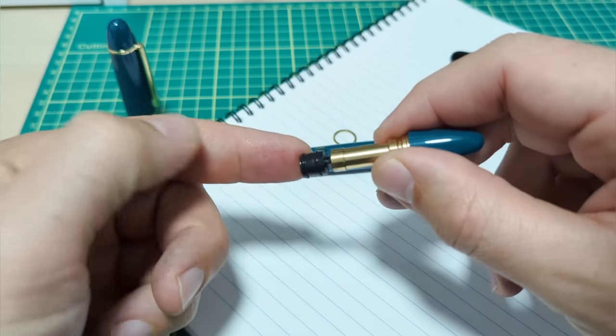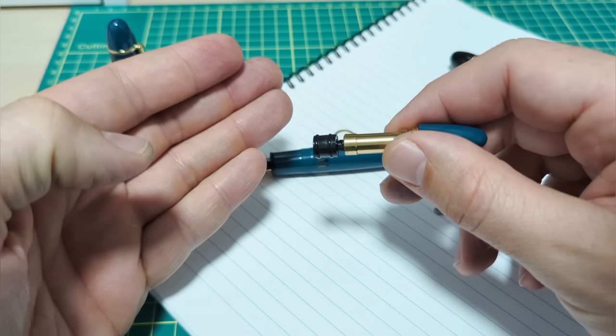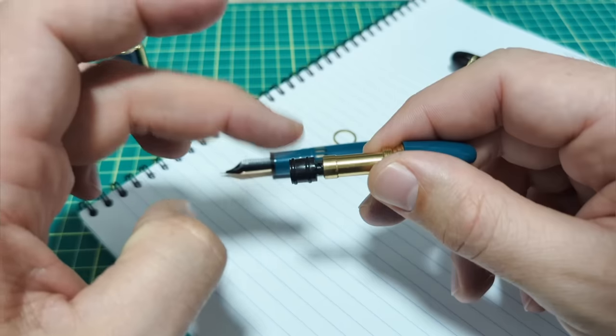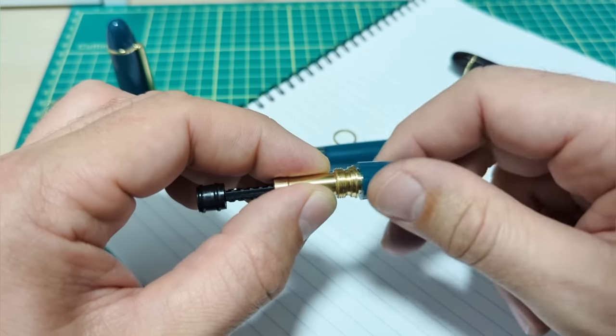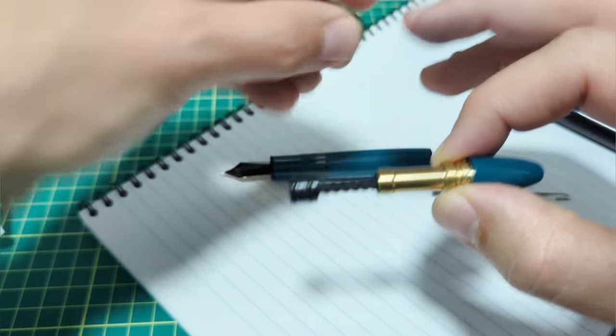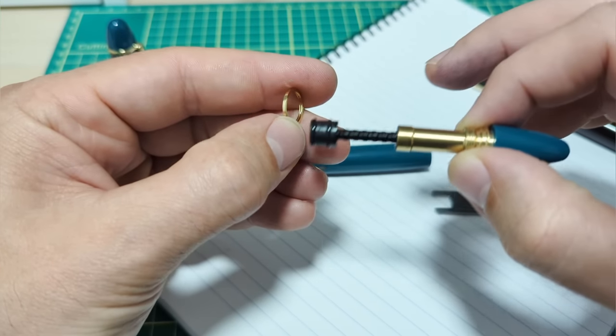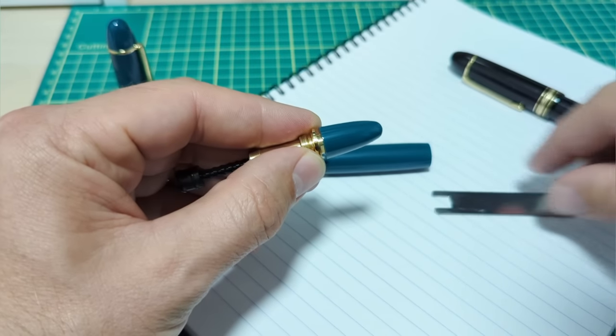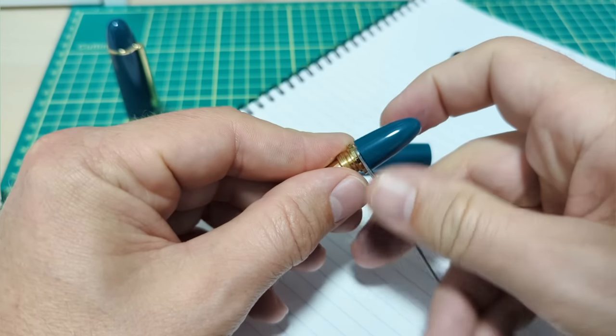These are greased - if you do this quick adjustment you might not need to re-grease it, but it's not a bad idea to put just a drop of silicone grease on there before sliding it back in. To put it back, extend the piston a little bit, then put on the trim ring noting the orientation.